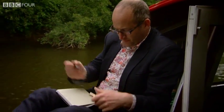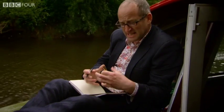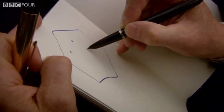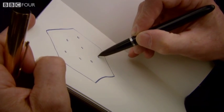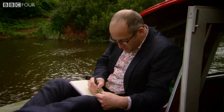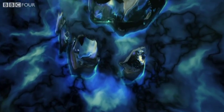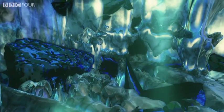Let me show you how it works. If this is a crystal of aluminium, we know that's really soft. What we need is something that's going to make it stronger. Well, he found an alloy which, when you leave it over time, tiny little crystals grow inside the aluminium crystals. They emerge out of the atomistic mist, and it's those that harden the crystal — they make it stronger, they reinforce it. As new crystals grow, they interfere with the lattice and the aluminium alloy's ability to shuffle atoms and change shape. This makes it harder and stronger.